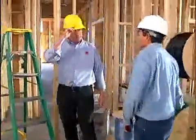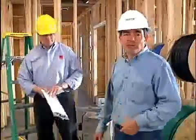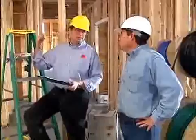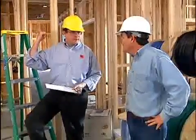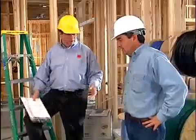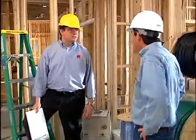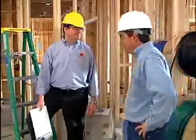Like we're finally ready to start pulling cable. Well, it sure does. The cable schedule we made earlier is going to tell us which cable we need to pull to which outlet location. It really doesn't matter if we pull from the outlet boxes back to the distribution center or from the center back out to the boxes. And we chose to keep our cable right here in the laundry room, so that we don't have to move the boxes and spools around so much.